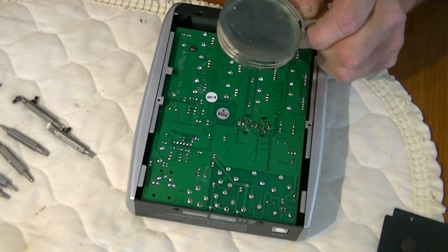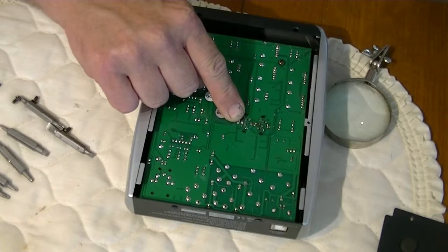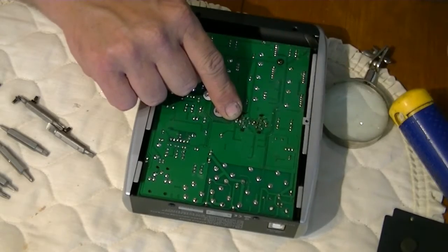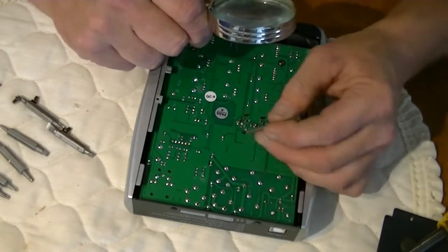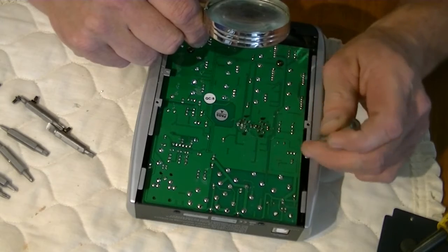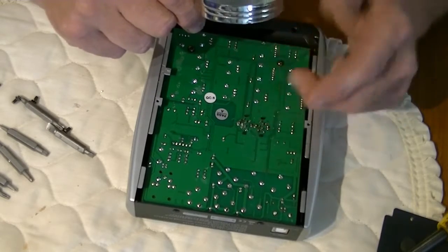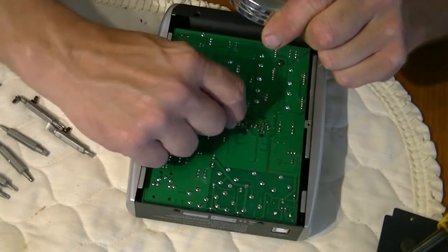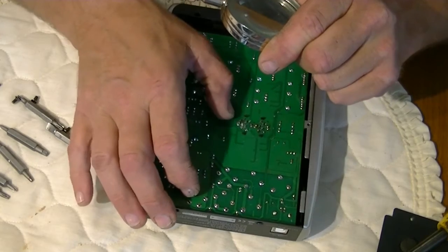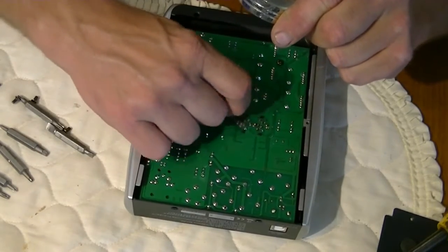Oh, we got a crossed solder joint here. Right here. Right where my finger is. Right in this little mess. I'll show you here. This blob of solder here is crossing right into here. It's like, oh my God, jeez. We got solder blobs running right along the trace lines. Oh, there's a solder ball that's actually right on it. Oh, we should be able to get that out. Good thing I got tools for this. Oh, there's a solder blob.